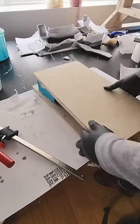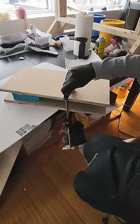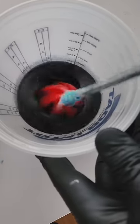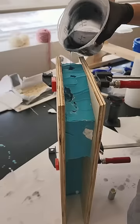Next, I put together our two-part mold, and then I sandwiched it between two pieces of plywood to add added pressure. Then I dyed the resin black, degassed it in my vacuum chamber to get rid of any air bubbles, and then poured it in the larger of the two pouring spouts.